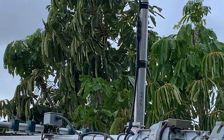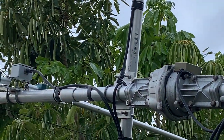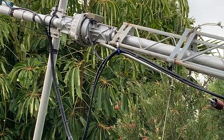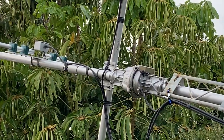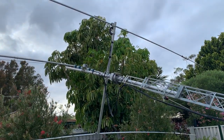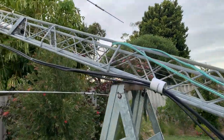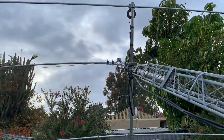I've double-checked everything and done all the wiring. In the next couple of days I'll do a final check before putting it up — check the rotator one more time and check the SWR on both antennas to make sure nothing unexpected has happened. Hopefully all going well I'll put it up, then hook it up in about a week or so. I've got a fair bit on at the moment including some wiring to sort out. Really glad I've got this LMR 400 — it's really good coax.